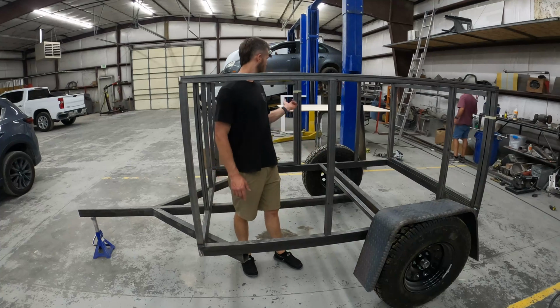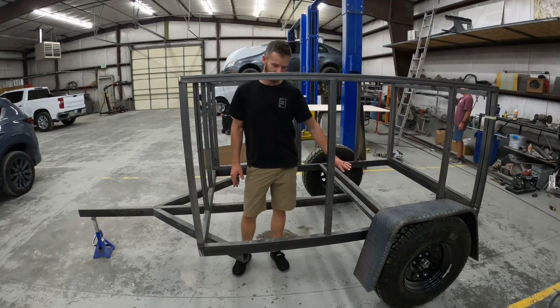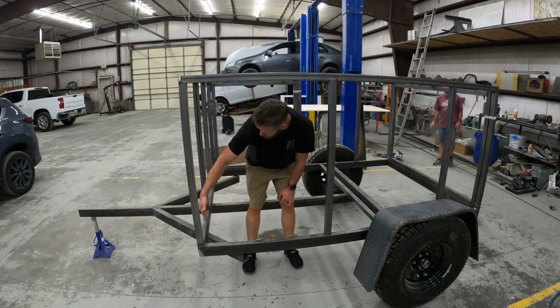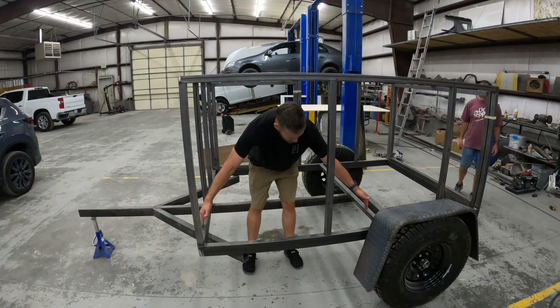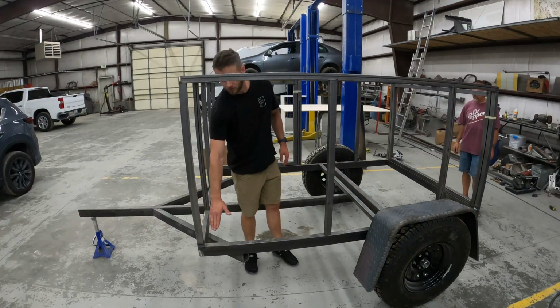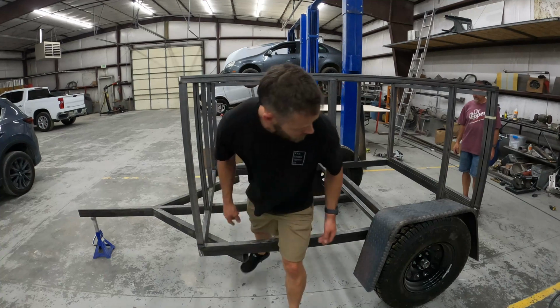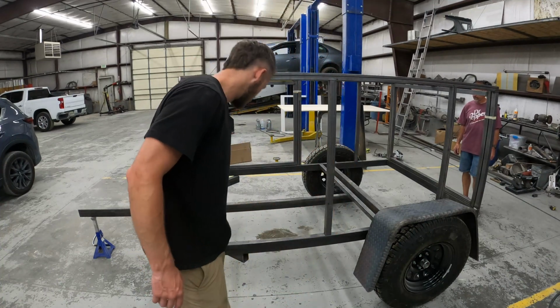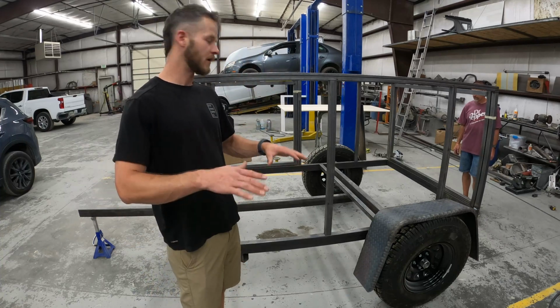So I've got 3/4 inch, right? Yep. We got 3/4 inch sanded plywood, so it'll look real nice. But we got to cut it to fit this. The first piece is going to come from the outer edge right here all the way up to the center of this beam. But then we have to notch it around all of these little side supports. So we'll cut the main piece with the circular saw, and then we'll use the jigsaw to cut out those little notches there. And hopefully we can get it just to fit right down in there.